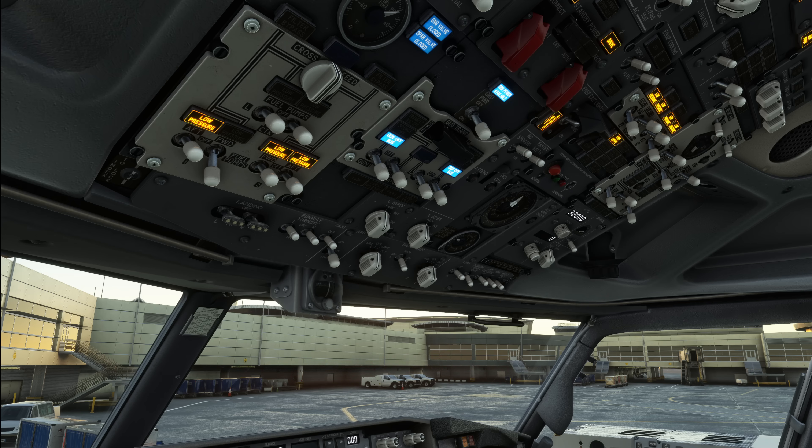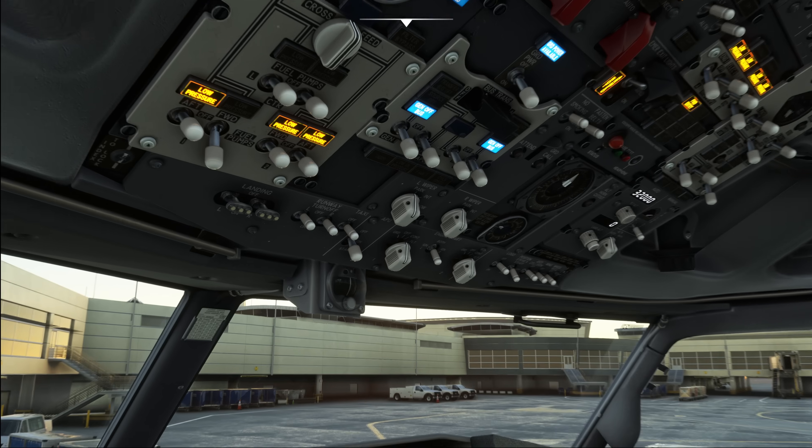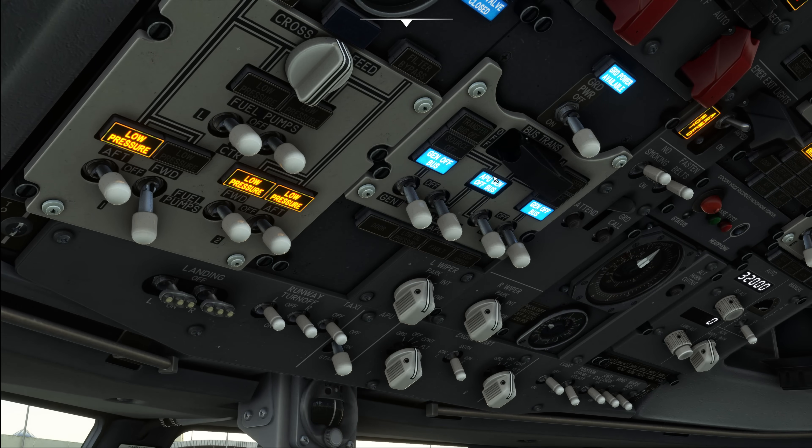The APU start procedure is now in progress, and once the APU start has completed you will see the APU generator off bus lights illuminate. There is no standard means for the flight crew to monitor the APU's progress — the EGT gauge has been removed in the MAX and there is no other gauge available. Only in the maintenance menus would you find some APU information. You simply let the APU start, and once the generator off bus light comes on, you know that your APU is available. The APU takes roughly a minute to start, and here it is.